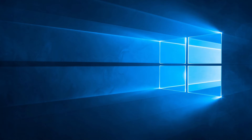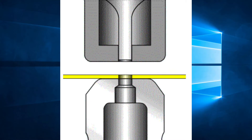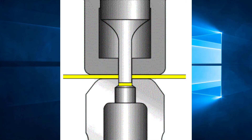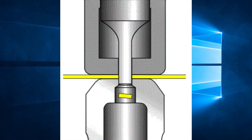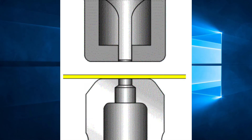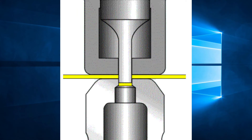So if the machine was a 30 ton machine, the RAM would hit the punch with the full force of 30 tons and the tool would hit the material with all 30 tons, even if 30 tons were not required. Once the RAM would come back up, it would go up to its original position. During this time, the punch would be ejected out of the material by the springs and the tool. Once the RAM returned to its original top position, it would give the signal to the control that it had finished the stroke.